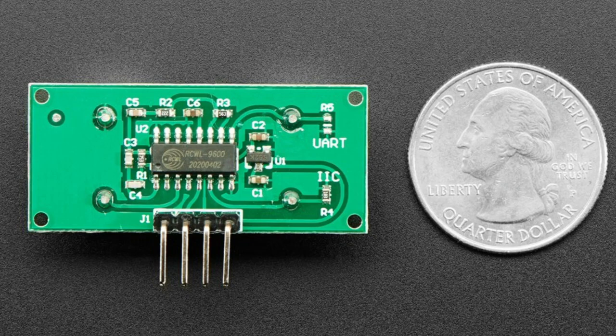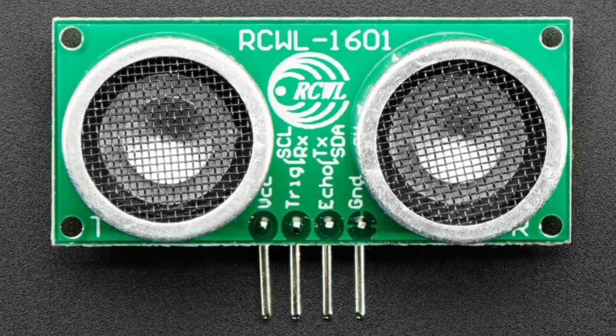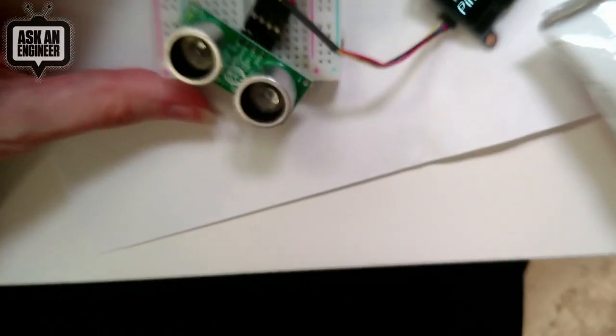Well, there's a lot of microcomputers and microcontrollers that may not have fast enough GPIO to do the HC-SR04 type trigger. There might be ones that don't have hardware UART. Maybe it's okay that you only have one device on the I2C bus. I still think this is quite useful. And also, there's a lot of microcontrollers that have multiple I2C buses. So if we go to the overhead...